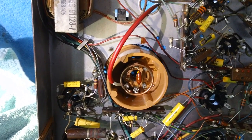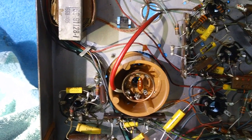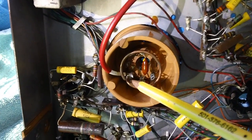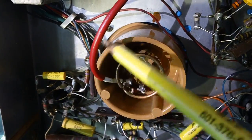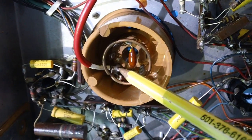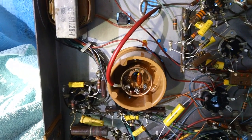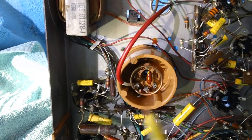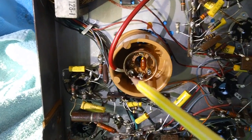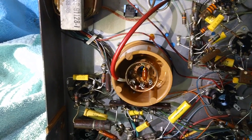And Brendan goes on to explain, when we are dealing with high voltage, any place that presents a sharp point or a sharp edge allows the electrons to pile up on it. Now he's talking about these connections down in here. And remember, this goes out to your picture tube. So we've got sharp edges right down in here. And he said it allows electrons to pile up on it. When there are enough electrons on that point, they can actually overcome the resistance of the air itself and arc right into the air and create a corona. A corona, which is a glowing arc, okay?